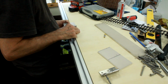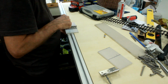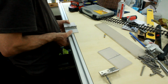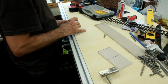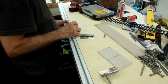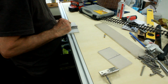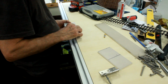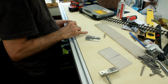But I can also then put extra screws in there, and if I want to, a couple more bolts or fixings through into the hinge, into the aluminium as well, so it will sort of spread that load. And then once all that's drilled out and fitted, I can do the same thing as I'm doing with everything else, cut down that line, knowing that it'll all go back together in a straight line and everything should be hunky-dory. So I think the first thing to do is to get that relief taken out of the bottom so that we can fit the hinge snugly onto the perspex.